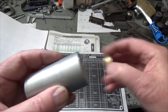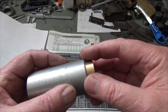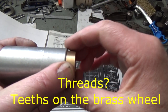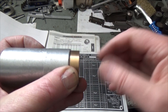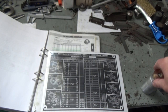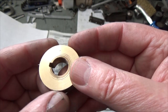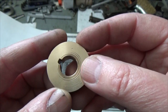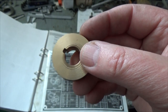I'll cut off a piece, drill it out, and then mount it together with this brass. The reason I'm doing that is: if I mount the aluminium shim together with the brass and then cut the teeth, I don't get any burrs on the gear — the burrs end up on the aluminium. The gear is metric, module 1.5, and the depth of the teeth will be 3 millimeters.